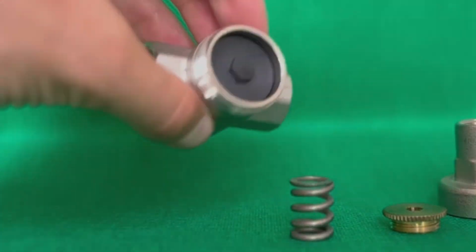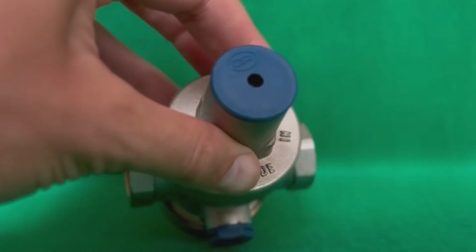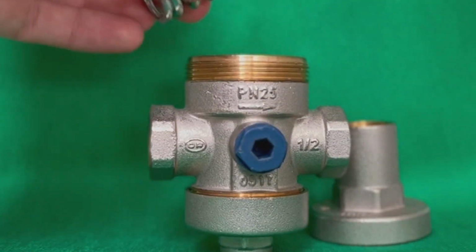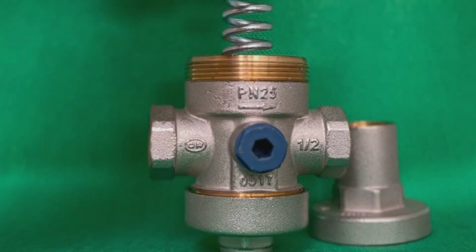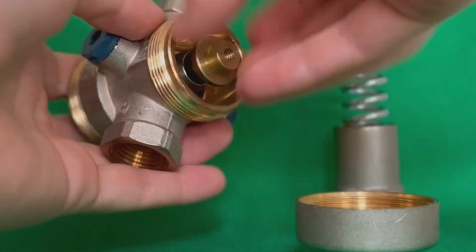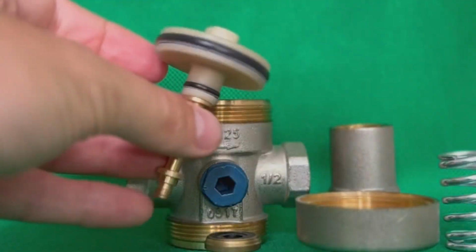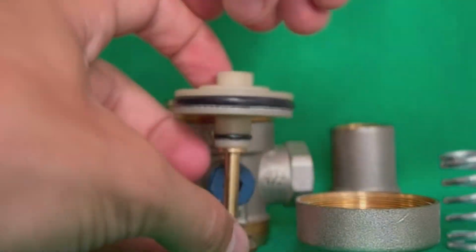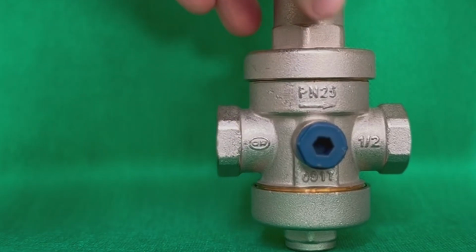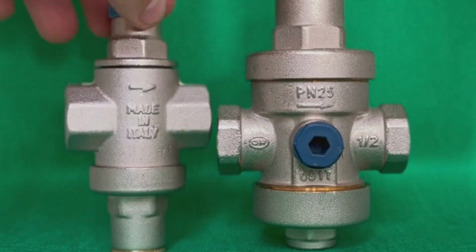The piston is located relative to the vertical axis. It consists of 2 parts. The lower part completely interrupts the flow of water at high pressure. The upper part receives the flow pressure. For better sliding and reduction of friction, 2 rings made of EPDM are installed in the upper part of the piston. More expensive PRVs are designed to work with high fluid pressure, up to 25 atmospheres. Cheaper models work at 15-16 bars.